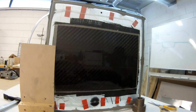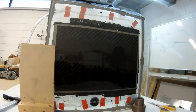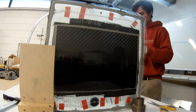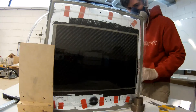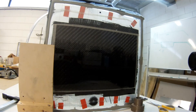I infused some carbon fiber onto a glass plate. Quite interesting to see is how the resin will flow on the mold side. Mostly you just see the back — you see the infusion along the infusion mesh going in straight lines. But when you look from the back, you will see the carbon fiber is not fully saturated as far as the line you see on the top of the mold.